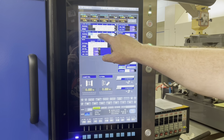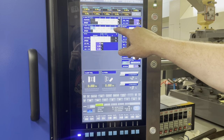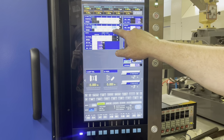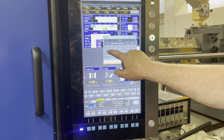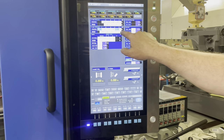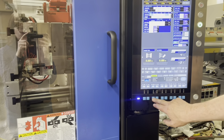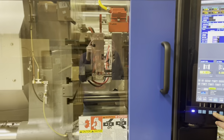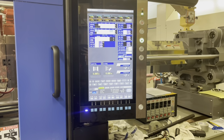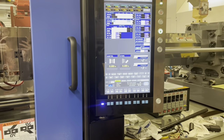I have a couple different speeds set in here. So I got 15 inches, 8 inches, 1 inch, 0.004, it's 60, 60, 60, 20. That one we could probably drop down to 40. So we set it as, and this is percentage of power. And so as it closes, it's going to slow down. So we should be able to see that when we hit open. And then when I close, you see it slowed down there at the last. So last 8 inches, it slowed to 40%, 1 inch at 20%. And then at the very last, it slowed to 10%.